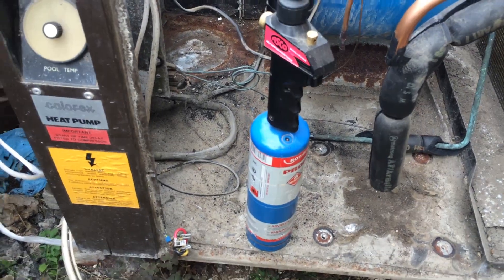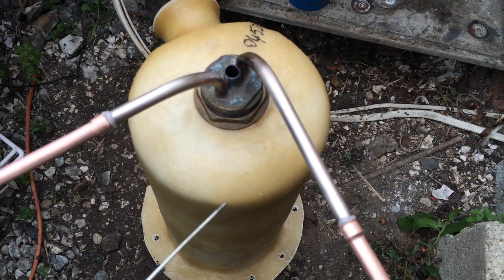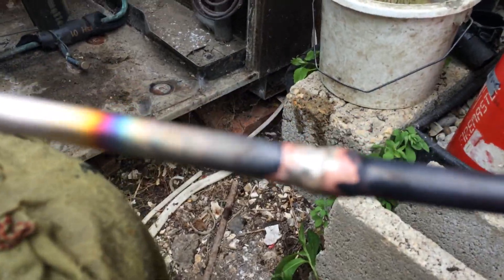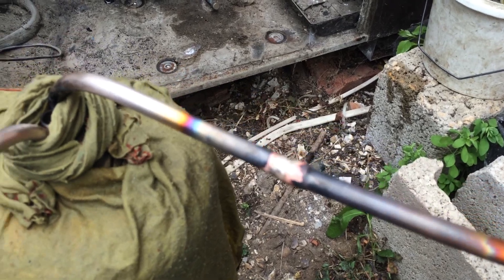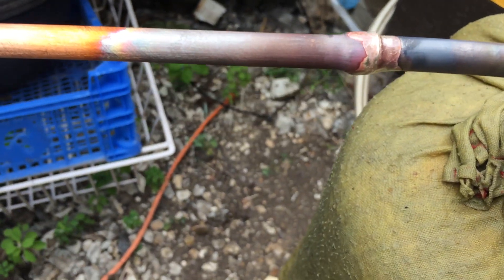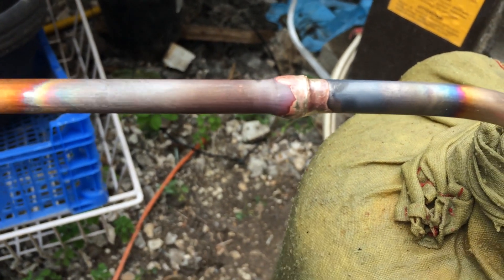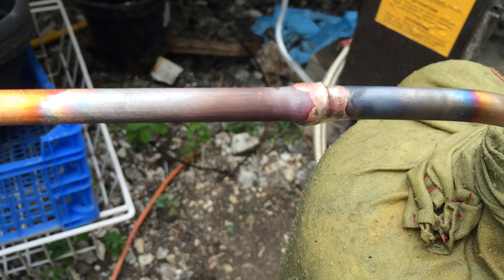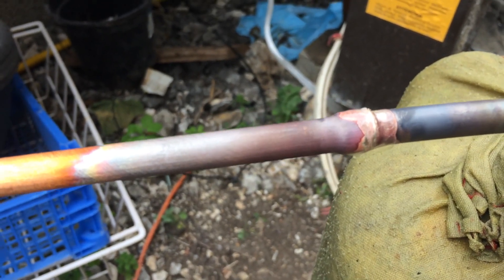You don't need a lot of heat so I'm using the propane torch. These are 56% silver rods, specific for doing stainless-to-copper joints. We've got number two done and the second one's gone a bit better. It's very fluid — once you get the solder warmed up it's like water, so you don't get a nice fillet on there at all. It gets sucked in. If you try and fill it up to get a nice curve, you'll put way too much in. It's more like plumbing solder than brazing in the way it behaves.